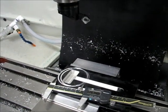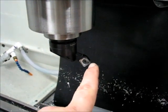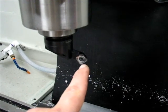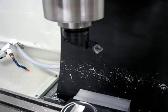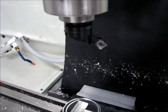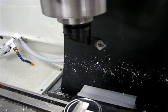I'm setting up my Tormach Superfly fly cutter diameter right now. The cutting diameter I want to set is the diameter that it cuts right to this corner — here's the primary cutting edge, and there's a flat surface at the bottom. It's the intersection of those two that I want to set the diameter. The diameter I want is a little over two and a half inches, so my goal is to cut two and a half inch wide paths without leaving any material on either side when working with two and a half inch wide stock.